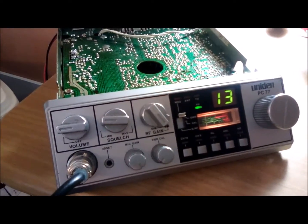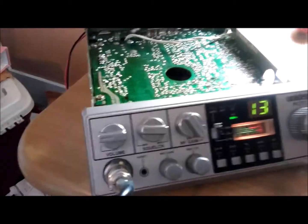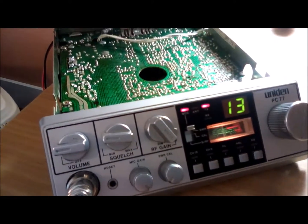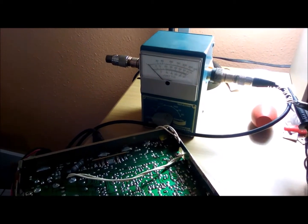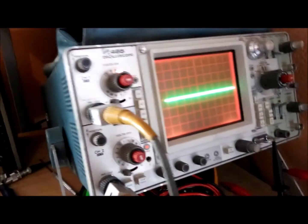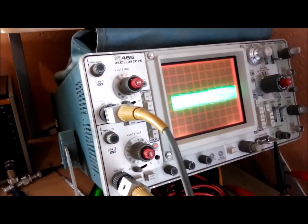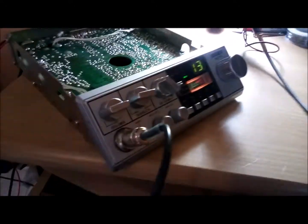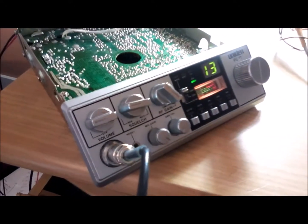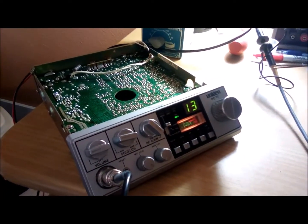It's not a powerhouse but it is working. I didn't have any mod before, just receive audio. I also checked the PA, hooked up a speaker, and had no PA - so I should have PA now. Audio test one two three four five, break break. Yeah, I've got everything cranked up - this microphone is on 10 and the mic gain is on max - it's not real loud but it is passing audio now.